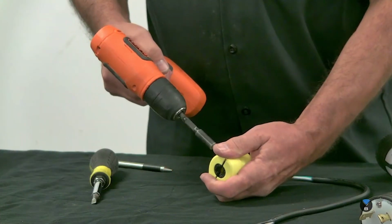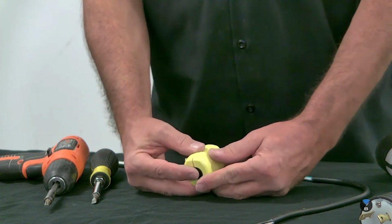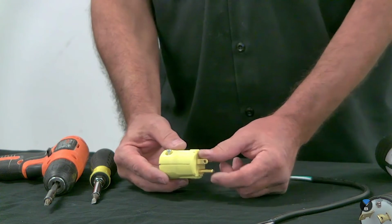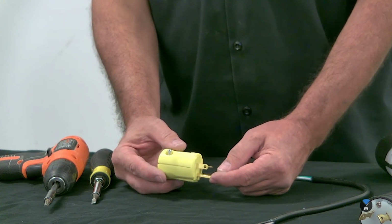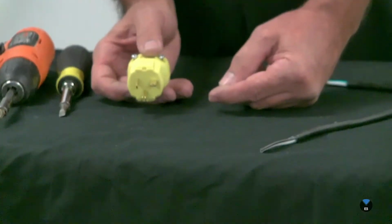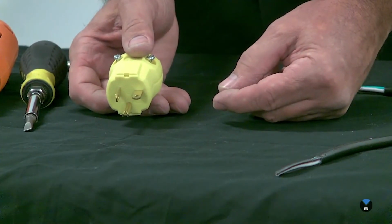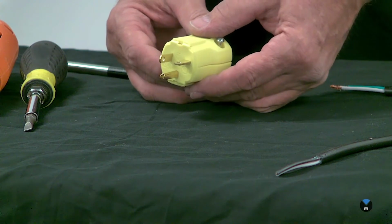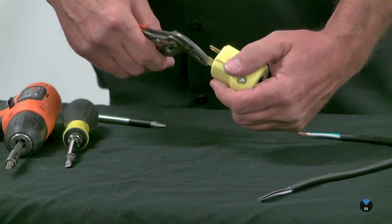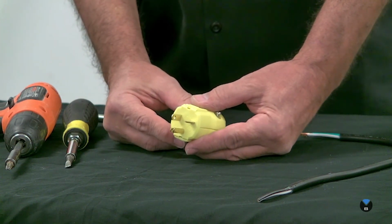And again, you're going to find a bunch of different configurations of the 120 volts also. And as long as the rating matches up, then you're okay to use it. Now, the reason I chose this one today is, notice it's got the bottom prong here, and that's the ground wire. But also, one of these is straight, and the other one is sideways. This is a 20 amp plug. A lot of the equipment that we use is a higher load, so it needs a 20 amp cord. Some of the equipment we sell comes with the 20 amp cord, and some people tend to make a mistake and they only have 2 straight prongs, so they'll grab this and twist it straight. That's not something you want to do. You have a machine that's pulling higher than 15 amps, and you're plugging it into a 15 amp outlet.